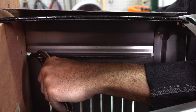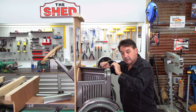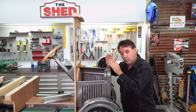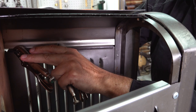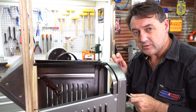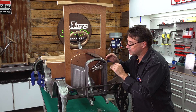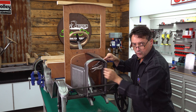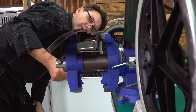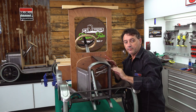I'll be putting some vice grips on the inside flanges just to lock this in place. The bend radius just has to be adjusted a little bit, so some manipulation with that. We can then mark our guillotine cut line as to where the bonnet is overlapping the center of the hinge. When clamping your vice grip, don't put too much pressure on it, otherwise you'll damage the face of the steel and then you'll have to repair it later on. How I go about resolving this issue of fitment is I start at the bottom - when I push it down, that tells me the horizontal fold just needs a little bit of manipulation to get it fitting correctly. Work from the bottom up to the next line, then work through the bend radius.